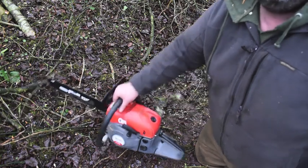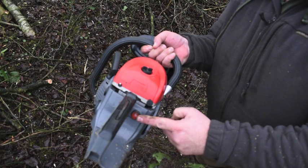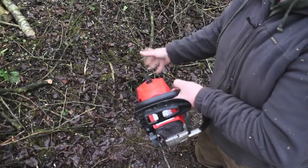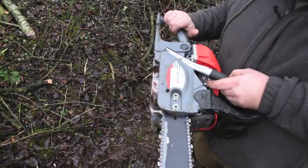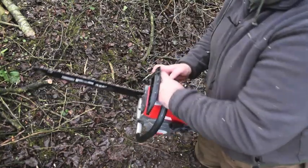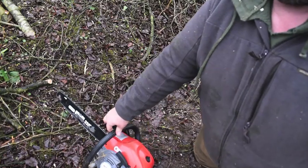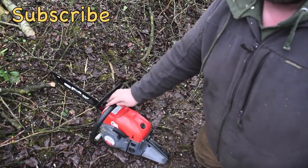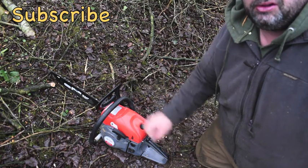We've got a primer bubble — I'll just show you that. Stop, start. Primer. Choke. Now it does have a decompression valve. I don't use decompression on this one because I know how this saw operates and I don't actually need to. It is a good running saw. You'd use decompression on higher compression engines. It's like starting a Stihl disc cutting saw really. With this machine I've found I don't use it. It's got a foot plate on the handle.